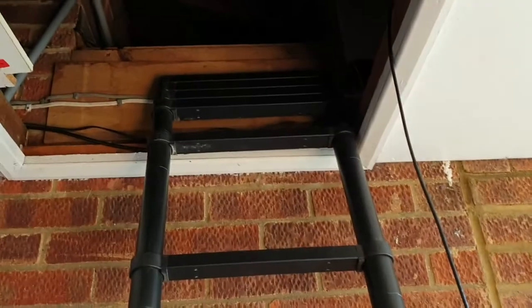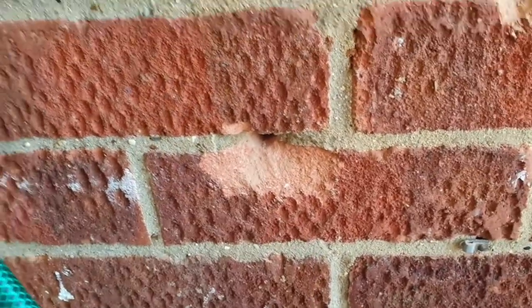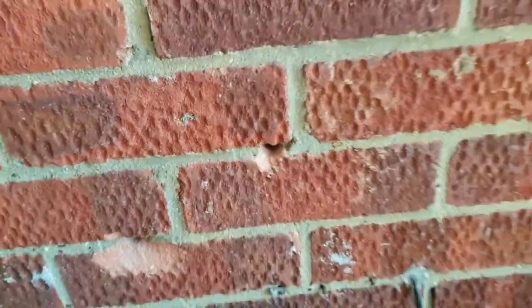Okay, now what I'm going to do is we've got our Ethernet cable here that needs to go all the way down from up there. So I'm going to put a conduit. I've already made a hole there from the inside. That is where our Ethernet cable will go in, where there's a router on the other side. I'm going to put a socket there, an additional socket they wanted, which I will be spurring from the consumer unit, which is in there.